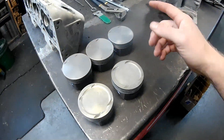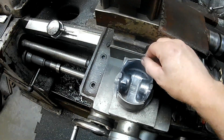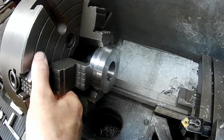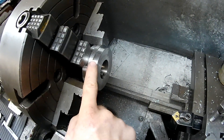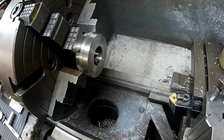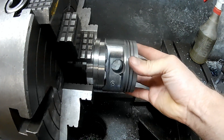I've got lots going on in a machine shop, but let me show you these pistons. We have a fairly easy setup. The factory machines this locating spigot in the bottom of the piston. I then chucked up a chunk of material and turned the diameter so that it fits in that spigot and machined the face just so it's flat. And we get something that locates nice.